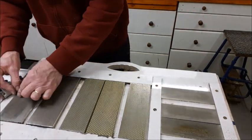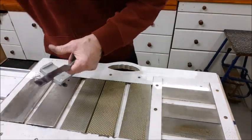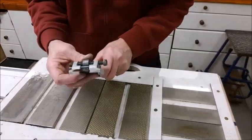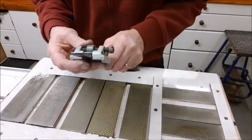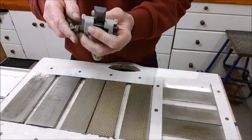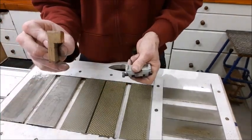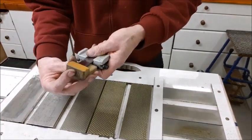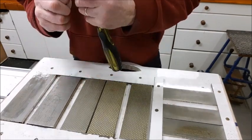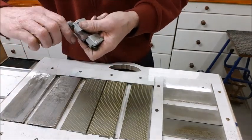When you clean that burr off — done. Now that is all clean and ready for the actual final sharpening. What we are doing now is setting the angle to 30 degrees, which is the smaller block — 30 millimetres. Slide it down till it touches, make sure everything is square, and nip it up fully.